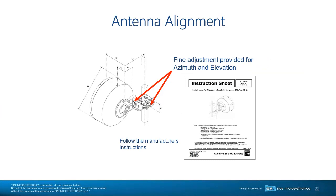Each antenna vendor has slightly different positions for the fine adjust bolts for azimuth and elevation. You need to look at the instruction sheet from the antenna vendor shipped with the antenna to find the fine adjust bolts. Make sure you don't keep them too tight when using the fine adjust. You need to get to a point where the lock washers on the back of those bolts are just expanded — enough tension that the antenna isn't slack and doesn't change alignment when you tighten it, but not so much pressure that the fine thread bolts seize up.